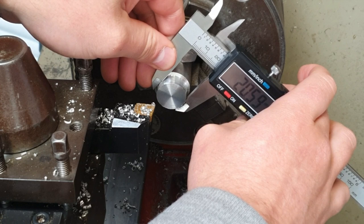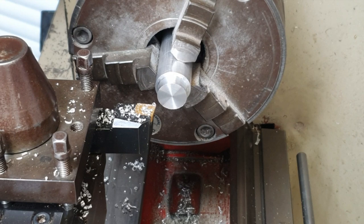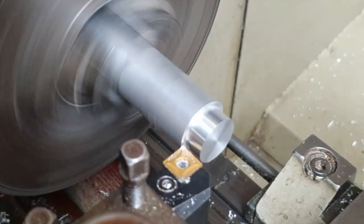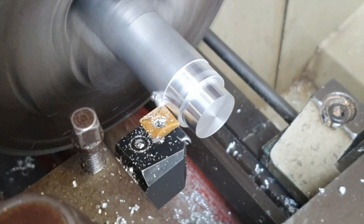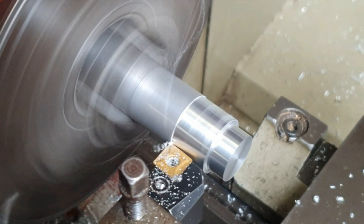So now I'm on 20.7mm, so now I want to start taking really small cuts — I'm going to take 0.1mm or 0.2mm off and continue on until I can get as close to the 20mm mark as I can. So there I am now around 20.08mm. Yeah, that's as good as I'm going to get now. I'll see you next time.